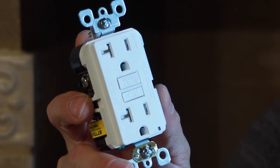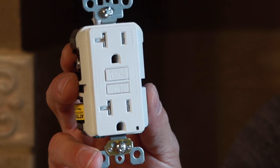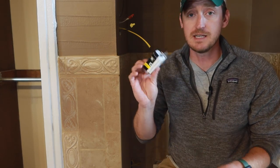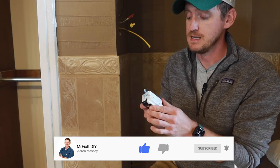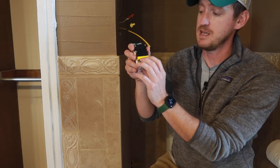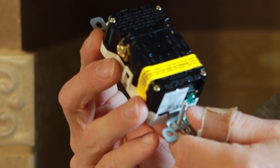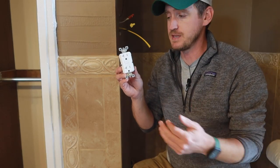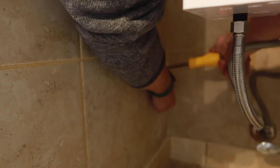Now that we've got our wire run through our box and down out the box below, I'm going to be installing a GFCI. A GFCI is a safety device — a trippable outlet — that stands for ground fault circuit interrupter. When there's a fault, the outlet trips and shuts off. Anywhere there's water, you'll typically find one of these. In this case, this is going to be a receptacle at the end of the circuit, so I'm just going to use the hot and neutral terminal plus the ground. I'm just going to do the line in on the brass terminal, the neutral wire on the silver terminal, and then we'll ground it with the ground wire.